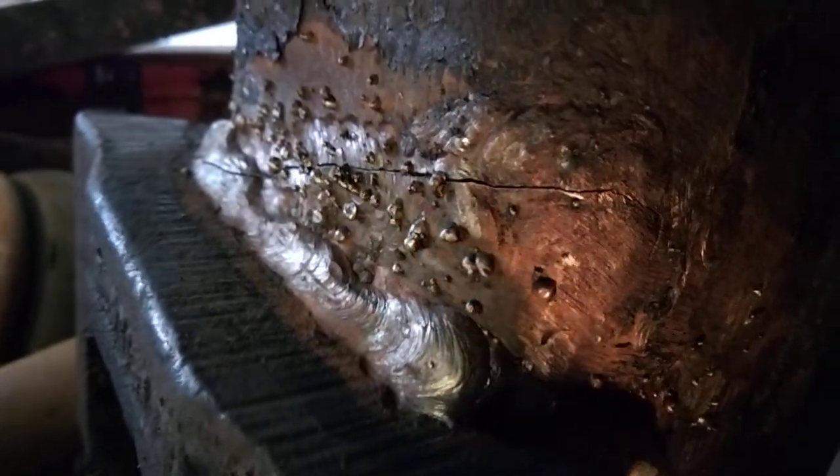Get it all V'd out. Anytime you see them big berries like that when you're welding — if you're using wire, that's 98% of the time that means you got the wrong polarity. Trying to run straight polarity wire on reverse polarity, that's what it'll do — it'll beat up like that before it gets to the steel.